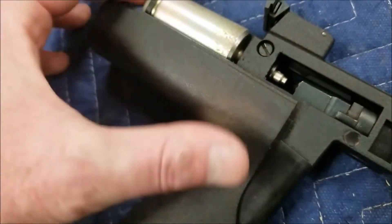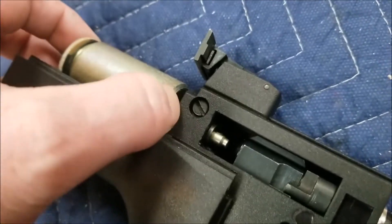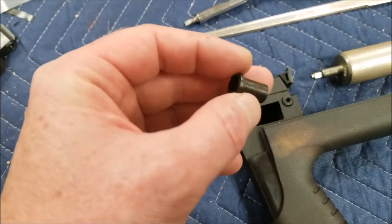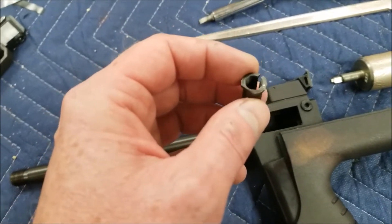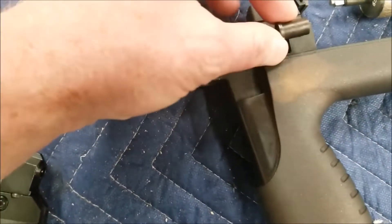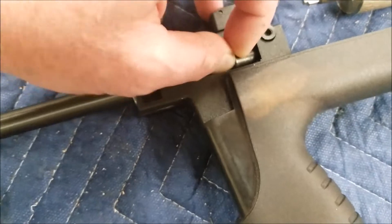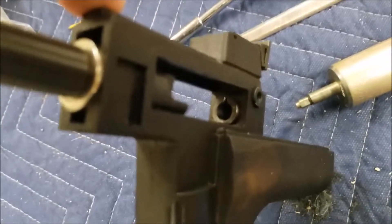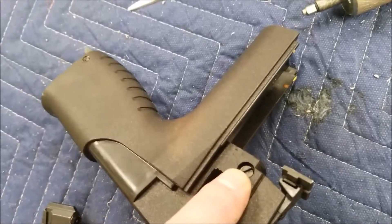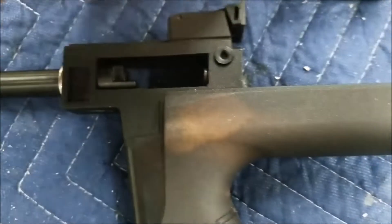It's supposed to slide forward. By pushing on the back of the solenoid, we can check — it's moving freely, and that's what we want. I went ahead and took the collar all the way out so you can get a better look at it. Note that flat spot on the bottom — that's for it to sit in there with that flat spot going towards the bottom of the frame, corresponding with a flat spot on the bottom. That gives you the right alignment for that screw to pinch the collar and pinch the threads.